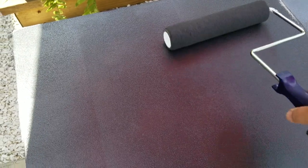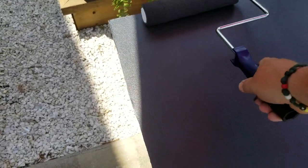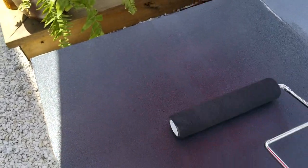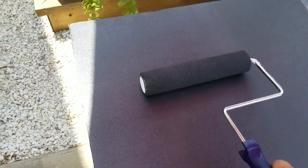Generally, I start with applying a little more pressure just to force some of the paint out, but I keep it thin on the roller. The reason why is because this rolls a lot like a gloss, and if you go in with a lot of material right off the bat, you can run into having roll lines that will dry — and you don't want that. Then ever decreasing the pressure so that at the end your finish roll, you're essentially just letting the weight of the roller roll out any of your texture.